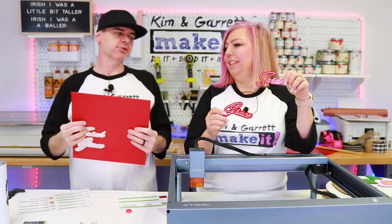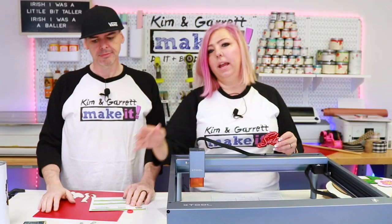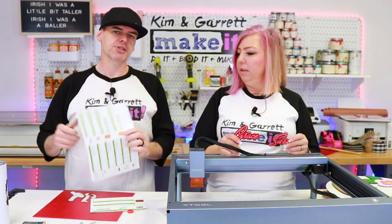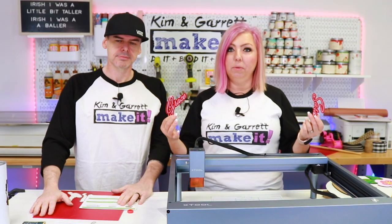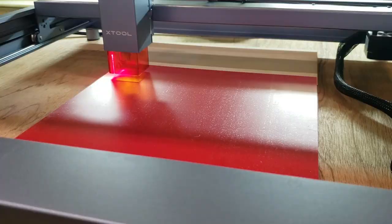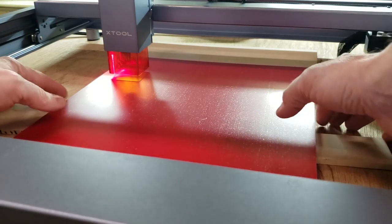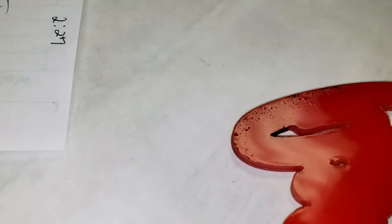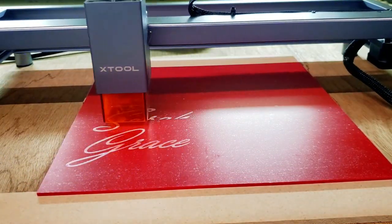Practical personalization project number three: acrylic tags. I was really excited about the acrylic tags — we haven't really done anything with acrylic. I really like how they send you all the little parameters for the laser for each material. Everything in the material box had its own cut guide, engraved guide, speed and power, and some precautions — like acrylic is not good for indoors. So we took this outside where there was a little more ventilation than what we have in this closed room with no windows. This project was very easy as well. Our tip is to elevate your acrylic off the cutting surface just a little bit — you'll see some burn marks on the cutting surface and there was a little burn on the back of the acrylic. Other than that, it worked perfectly. It took about 25 minutes per name.